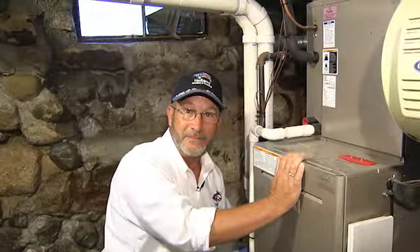Watch for freezing or frosted refrigerant piping as it connects to your furnace or to the outside unit. Frosted piping can mean one of two things: either you have a dirty filter and you're not allowing enough airflow to come through, or more than likely you are low on Freon or refrigerant. Running your unit with frosted piping can cause problems and cost you more money in the long run.